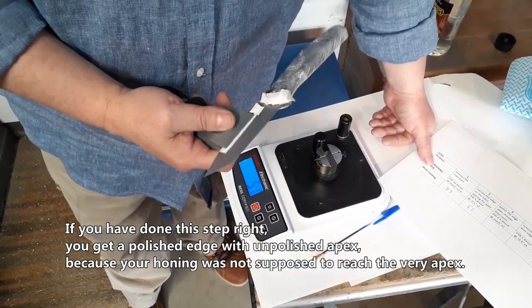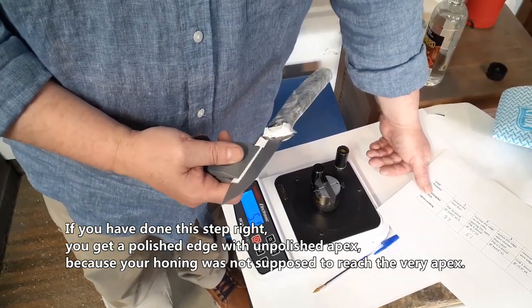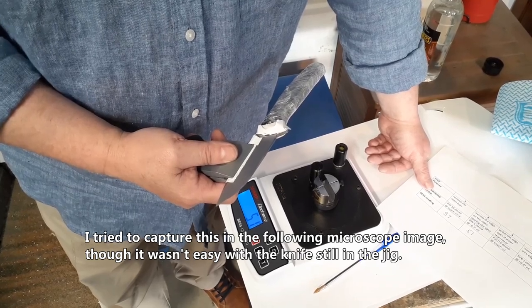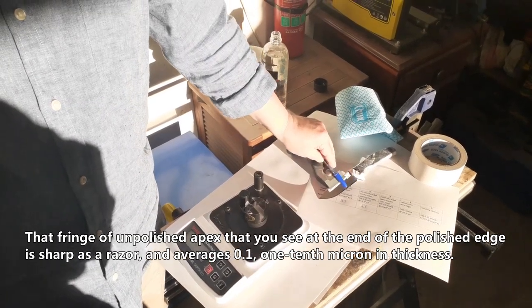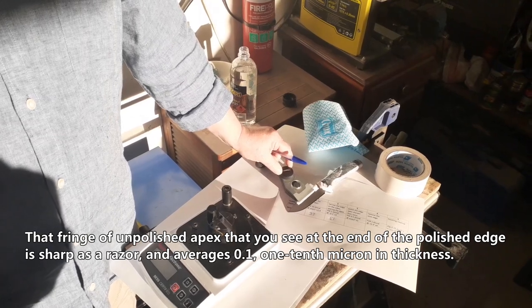If you have done this step right, you get a polished edge with unpolished apex, because your honing was not supposed to reach the very apex. I tried to capture this in the following microscope image, though it wasn't easy with the knife still in the jig. That fringe of unpolished apex that you see at the end of the polished edge is sharp as a razor